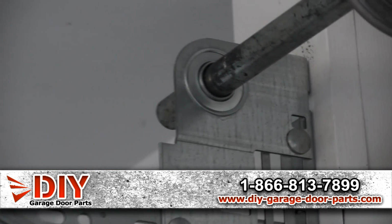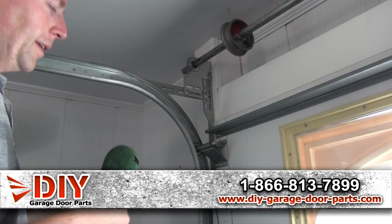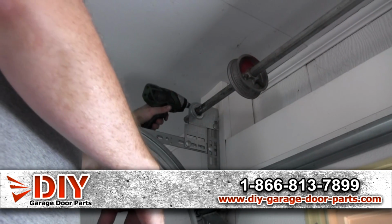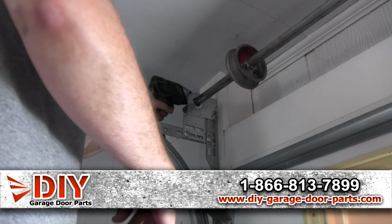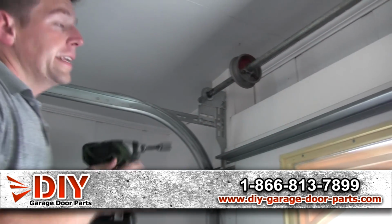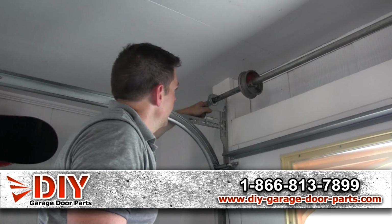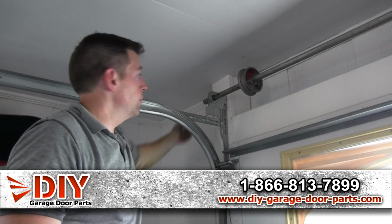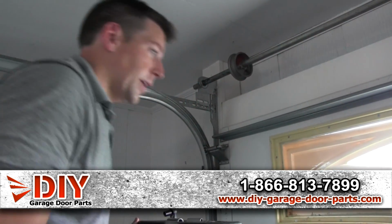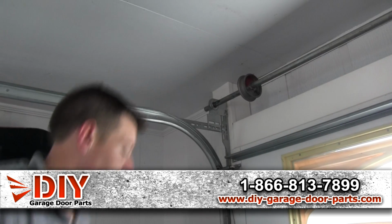And in this case, we're gonna go ahead and put the wood lag back in. If you can get a wood lag in, it's a good idea to put it in. It's just extra secure, and it's not gonna allow any side movement and wear out the bearings prematurely. Okay, so next we're gonna move over to the right-hand side and change out that end bearing plate.